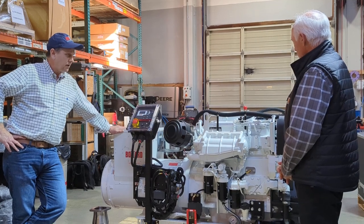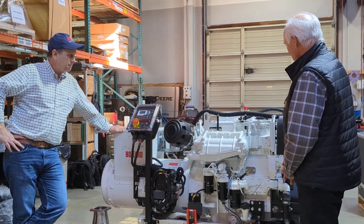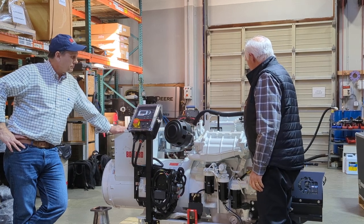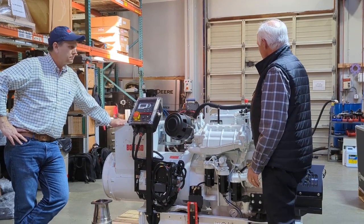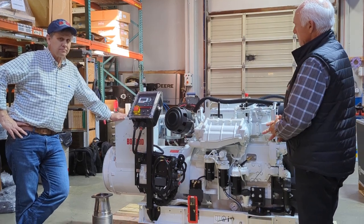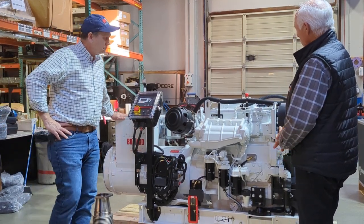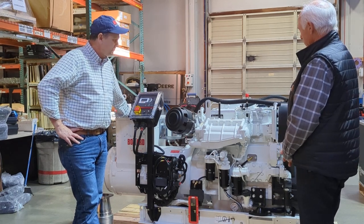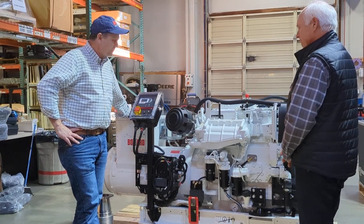And that is just a typical BOLLARD. This particular one is built with, instead of a pressure cap on the expansion tank, it's designed to go up to a makeup tank that services several engines, and then we put a Murphy coolant level shutdown or safety device on the makeup tank. Great. That's about it.